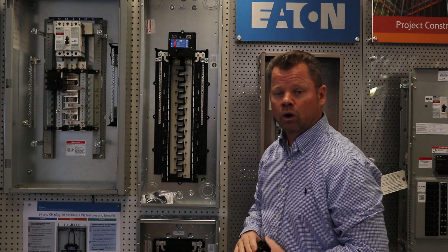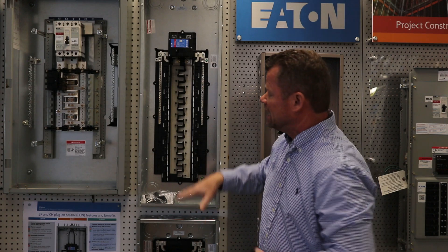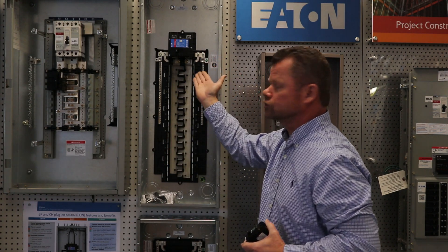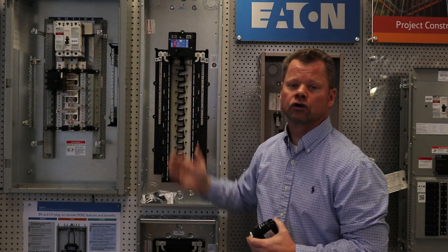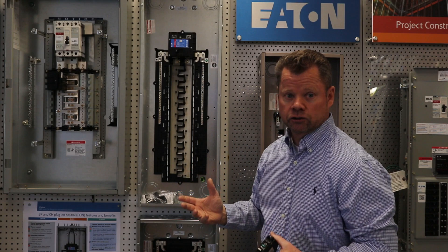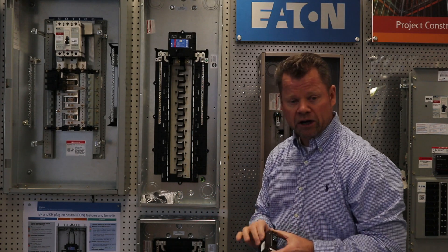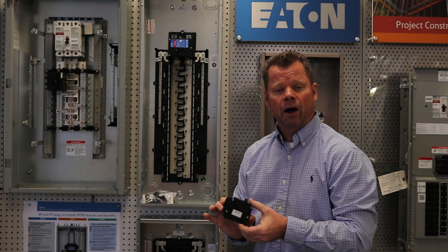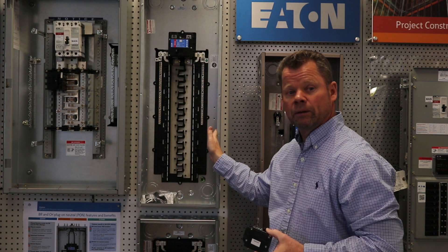which gives you more room to work — speed and fast. Everything is turned in: your neutrals are turned in, your feeder circuits are turned in, everything is turned in towards the center of the panel itself. Really nice feature. Some more nice features are the breakers. As you notice, the breakers are a smaller design, shorter body length, which gives you more gutter space to work.